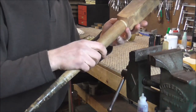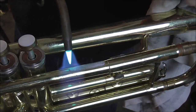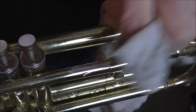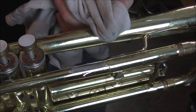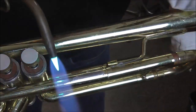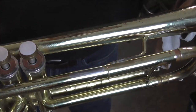After you're done it will still have the solder color but all the solder will be off. Then I take this thing — it looks like a table leg — it's called a wooden assembly mandrill and I use that to hold the trumpet while I work on that part of it. I clean this solder joint the same way. You heat it up for a few seconds and you can see when the solder melts, then you remove the flame and wipe it. If you need to, move the t-shirt material to a clean spot. You can see that the solder went onto the lacquer — sometimes that just pops right off. I need to clean that just a little bit more; there's still a little bit of solder left on there. Okay, that is clean.